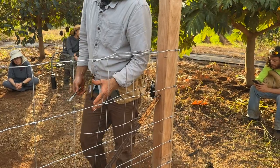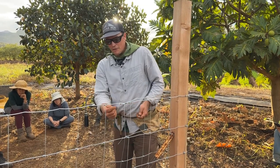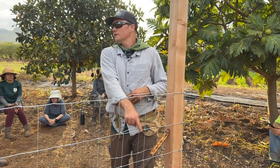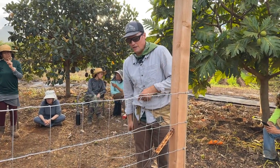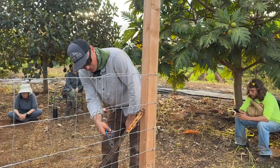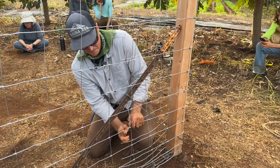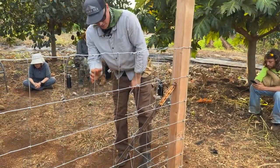You don't need to go crazy — a couple of turns is okay. You're setting it up like this in case you have to come back later. And every turn you make, you're adding a potential rust and weak point to it — those turns are adding, on the long haul in 15 years, this is what's going to rust before this does. Water is going to sit there, moisture is going to sit there — it's the little things you see over the long period of time. So you do that all the way down, and you would just kind of cut these stays out so you could go around that, or just come right over it.